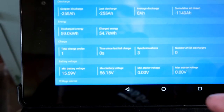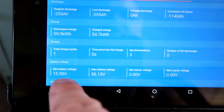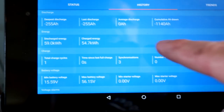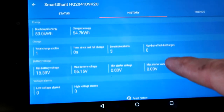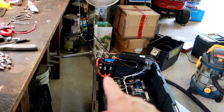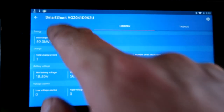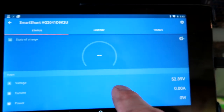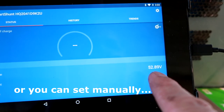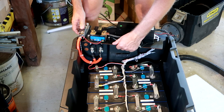This is the first view at the shunt — it still has the history in here: min battery voltage, max battery voltage, total discharge, synchronizations. So it doesn't delete the history, as some people said it would. I've connected it to the most positive terminal permanently, not via the switch. If you want to, you can connect it to the switch so when you turn off your main switch it will turn off the BMS as well. It will keep the history — the only thing it loses is the state of charge, but it will have to wait until we reach 54 volts to recalibrate to 100 percent.